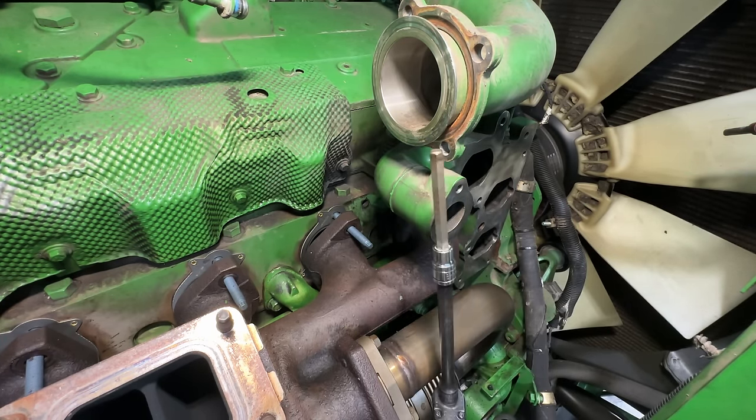This is my oh crap box number 3. So in here, got a brand new set of cobalt Milwaukee bits. This kit here, we have some reversible countersinks. Some extra drill bits. I keep these on hand because I can put these in a long extension and get down deep in a hole to drill a bolt out. So like those. And this is just a bunch of extra taps.